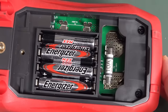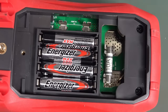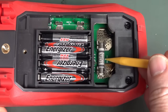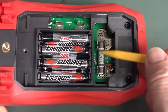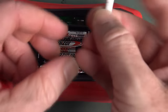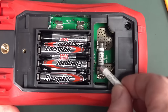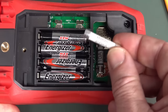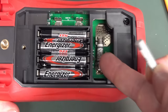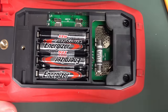Definitely one of the benefits of the new model is that you can access the fuses without screwing off the case like you had to on the previous E model. The annoying thing about these BS1362 fuses is that they're not the same length as your regular high-voltage 1000V multimeter fuses, so in theory you can't replace them with higher-voltage fuses — you're stuck with 250 volts, unless you can find one in that size in a 1000V range.